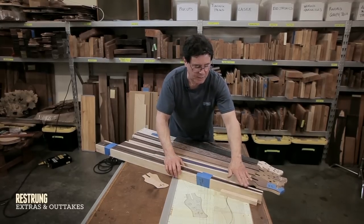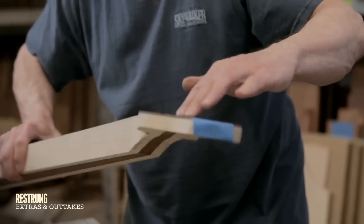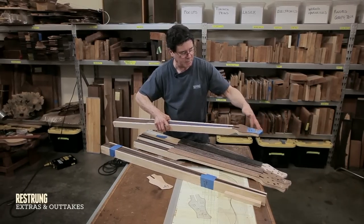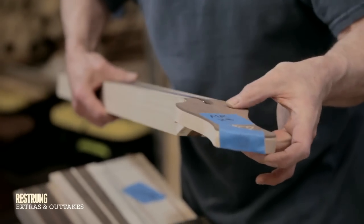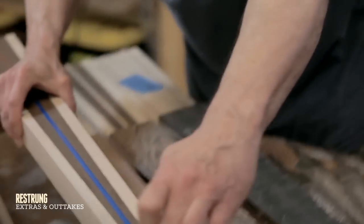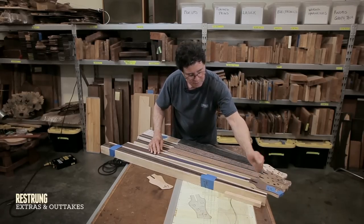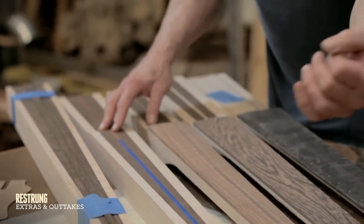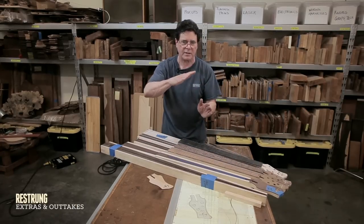After this is laminated, I'll cut the silhouette and move to the next phase. At this point I've glued on a cap — this happens to be walnut — and I've got the basic shape cut out. I've cut the back enough so that clamps can clamp on in a straight way. I've also routed for the truss rod. The truss rod fits right in there, and eventually you can put an allen wrench in — move it one direction and it will make it convex, another direction and it'll make it concave. So you have total control when the string tension is on the neck to adjust the flatness of the neck.